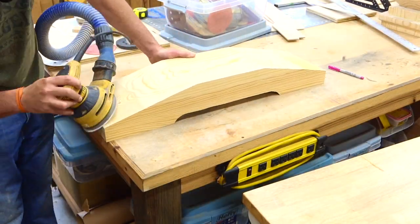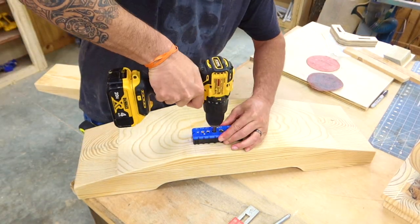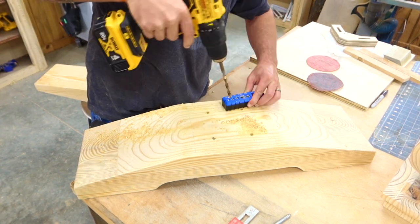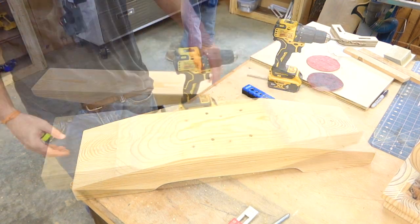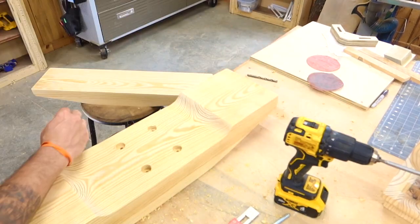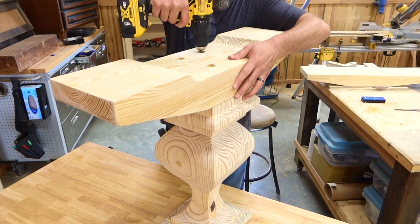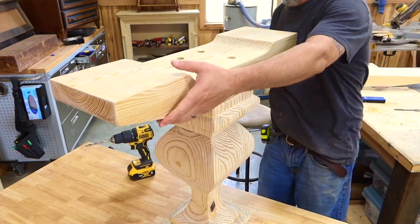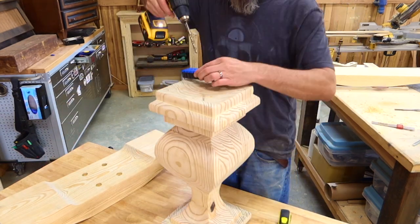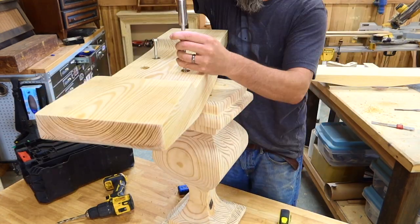Back to sanding. Now to attach the bottom and tops to the pedestal, we're going to be using lag screws. If you decide to make these to sell, you actually ship them unassembled — pre-drill your holes, send the lag screws, and it will cut way down on your shipping. Drill four holes into the base and make a countersink. Pre-drill the base itself so it does not split when you put in the lag screws. Line up the drill bit to barely make a mark onto the bottom of the base — this tells you exactly where to pre-drill so the holes line up perfectly. For this particular base, use six inch lag screws.